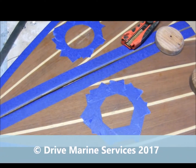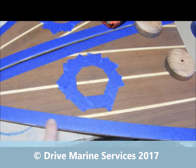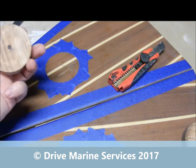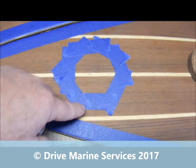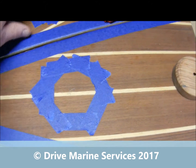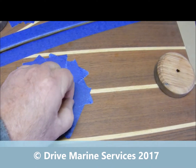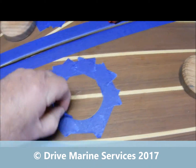These are the fore and aft covers for a Bellinger canoe. We're going to glue these on. I've masked the edge and we're going to glue these blocks in the middle to put saddles on. I've marked it out, then put masking tape down, put the block back down, and cut it out. Once you cut around it with a knife, you just peel the edge back, and when we glue it you'll end up with nice neat surfaces.